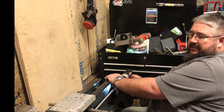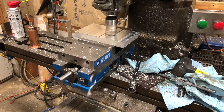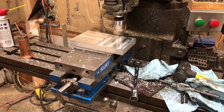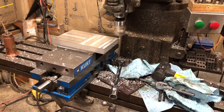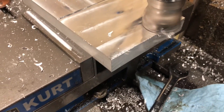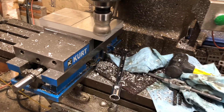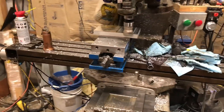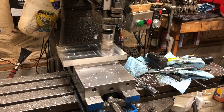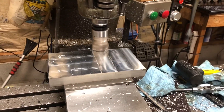You guys, we're running this face mill again and we're taking 40 thousandths per step at 40 inches a minute at 2,000 RPM. It's coming out pretty good — decent finish. We're cramming it in there pretty hard; we're going about 4.5 amps on the motor, which is basically its full load. Yeah, almost 5 amps — we're a little bit over the full load on the motor but it seems to like it pretty well.